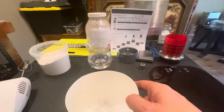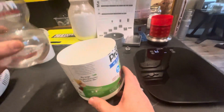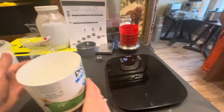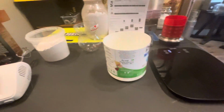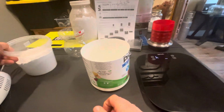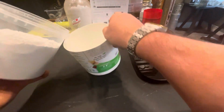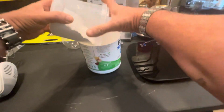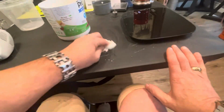All right, so definitely everyone does this differently, and there are no recommendations here. Is the water still nice and cold? So I've been talking that long. I like to definitely have my water in the flask and pour the powder on top of it. Okay, I'm going to put up my little mask. Yep, silica and cristobalite. You don't want to breathe either one. So let's try to get this in here as dust-free as possible. There's some dust. Plop, bunch of water. There's a lot of dust. Glad I'm wearing a mask.